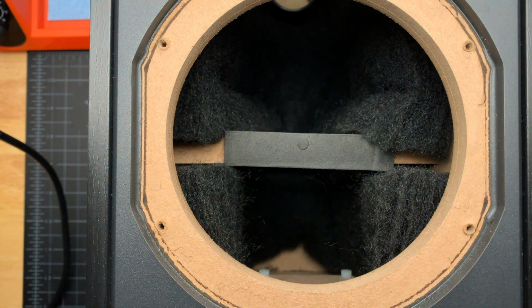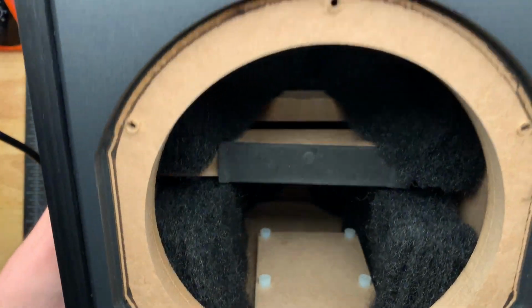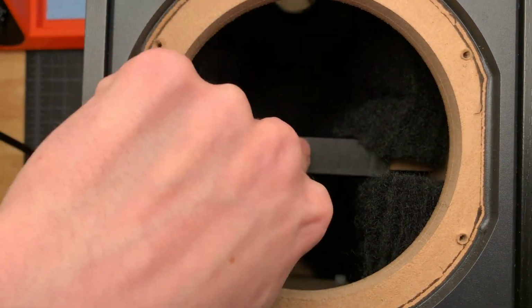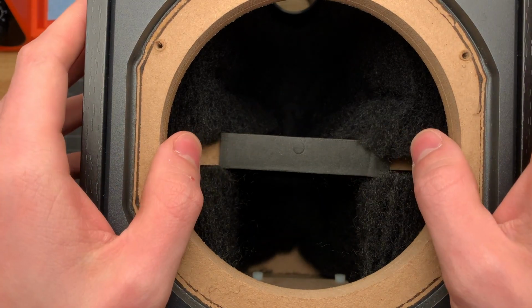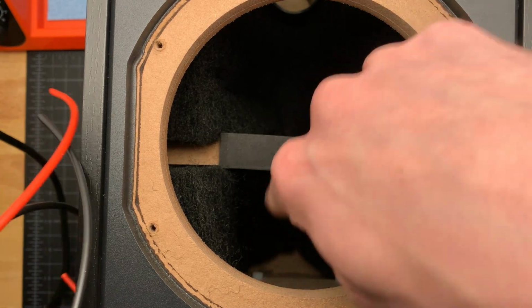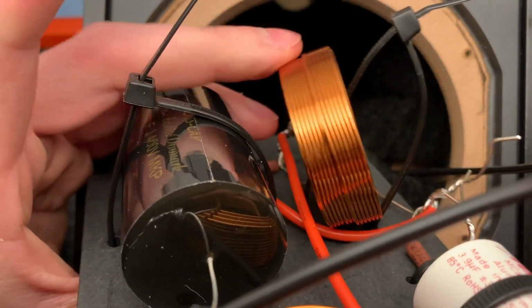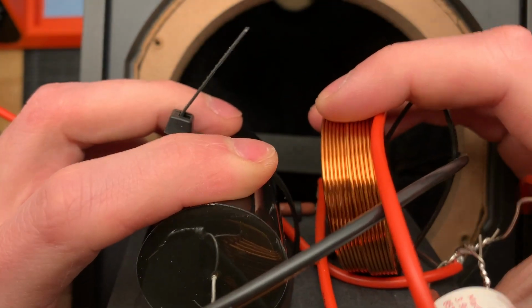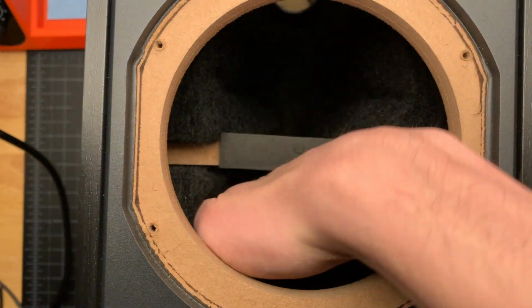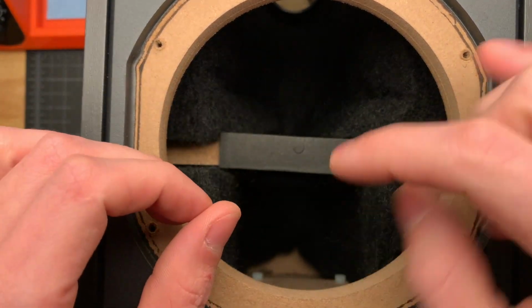So here is the enclosure for the Borea, and you'll notice there's this wonderful brace that has 2 horizontal beams going across, one further up and then one further down in. While there is enough space vertically, from the base to the bottom of that support, to fit all this stuff in here, even with this tall inductor standing upright, the problem is getting it in there, because you have to angle it down and then flatten it out. There is not enough space to have the components tightly tied down before it goes in here.